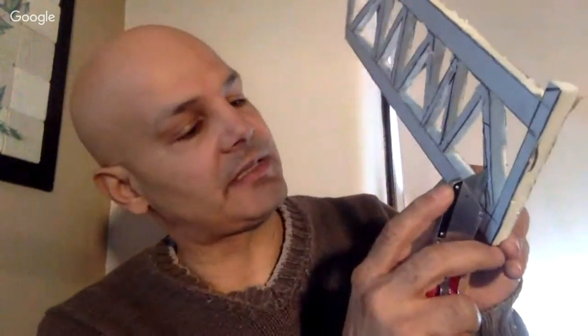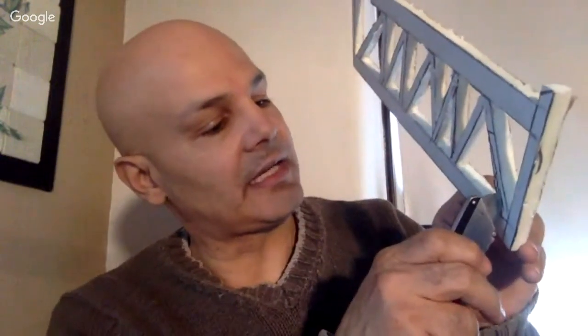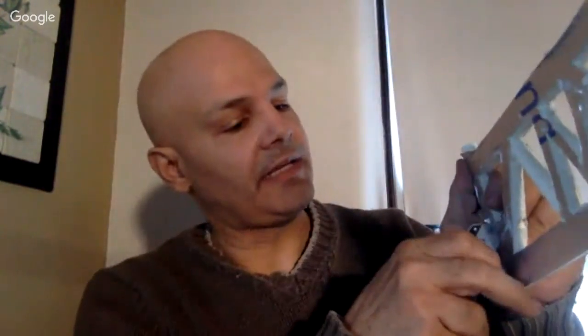But let's do this. Let's put a crack in here, and I'm going to use my knife and go all the way through with it. They did not show it all the way through, but I am taking some liberties because I'm saying it's insignificant. You can call it 3/4 or not. Actually, that would cause a rotation if it was in balance. Remember, everything's in equilibrium. So if I put an L-shaped support on it, it's going to have its issues and not be in equilibrium. You could make it work, though. You'd have to design that L to transfer the load without torquing, without twisting.